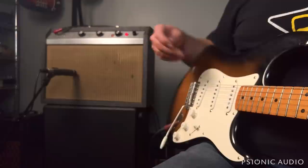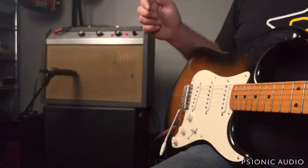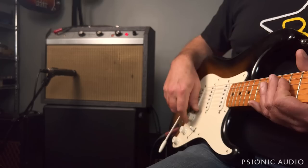I'm going to switch over to my speaker and hear what the amp itself actually sounds like. I suspect this amp is on the bright side. It does not have any high frequency attenuation in the output section, which is common to EL84 and similar amps — cathode-biased amps — whether it's a cut control or something else. Sometimes it'll be a zobel network. There's often something keeping the output from getting a little bit fizzy because of reflected high impedance with this kind of tube.